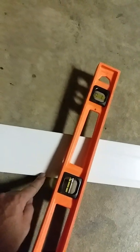So what I did was I drew my lines. I set that up on the back of the car, and I got my lines, and I would draw my line here and here, and I would make a line right here, and then I just put this up on the edge of my countertop and lined it up and put a piece of wood on it and just bent it, folded it down. So these are my scraps. If you don't have a brake at home to do metal, this is pretty lightweight stuff. So imagine a line there, set that on there, and then just push down, and it'll make a straight bend.